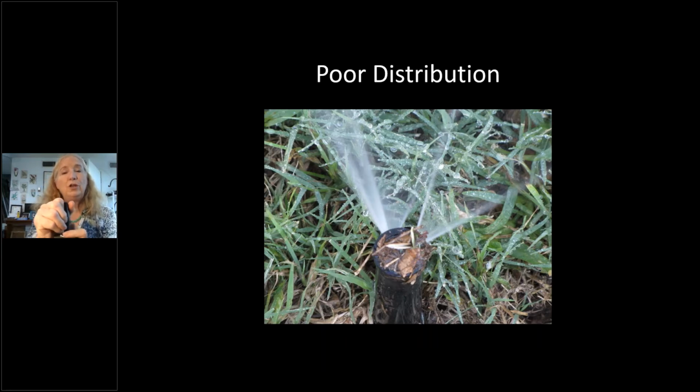There is a tool that you can buy anywhere that sells irrigation supplies. It looks like a cool tool. And we can pinch this and open it and then put this around the riser. Are you seeing that? And it can hold that riser up for us. There's a tension bar right here that we can lessen the tension or make the tension tighter to hold that up for us.